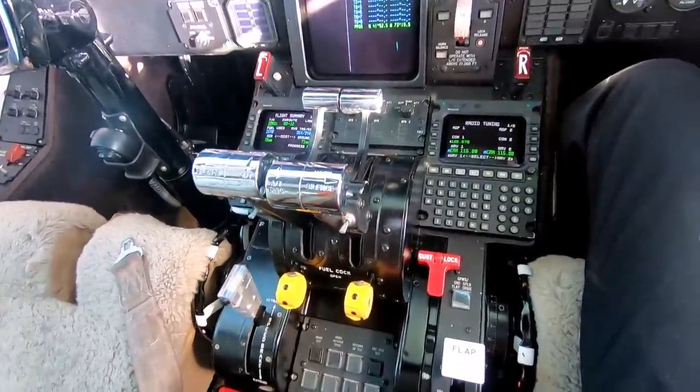The reason for that is the throttle cable. There's actually a physical cable that runs from the throttle quadrant here in the cockpit all the way back to the engines, on the fuel control valve, controlling how much fuel goes into the engine. Along the way on that cable we have sensors and servos and things like that controlling things, but one of those is the auto throttle servo — and it's very susceptible to tension change on that cable.